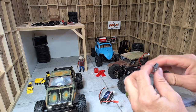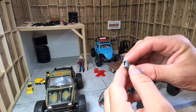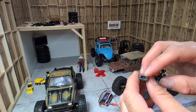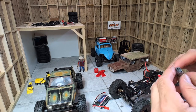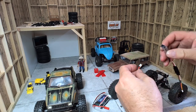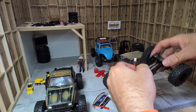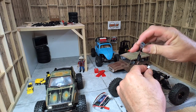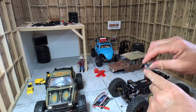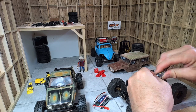This is the motor side. It's got three ports for brushed — there aren't really directions, but online he says the middle post is always positive. On a brushless system you can change one of the poles, but I'm not sure how this works technically for brushed. The connectors are PH on the motor side. If I put it in on that side, the positive's on the outside and the black's in the middle. If I put it on the other side, my red's in the middle — so I'm going to try that.